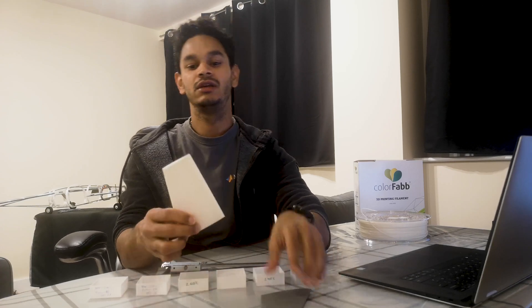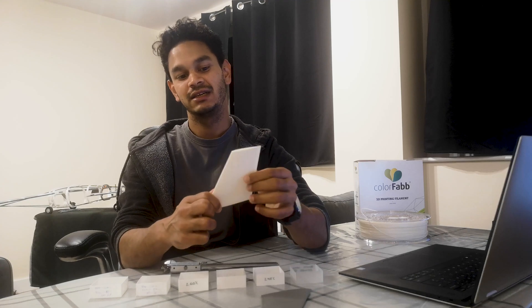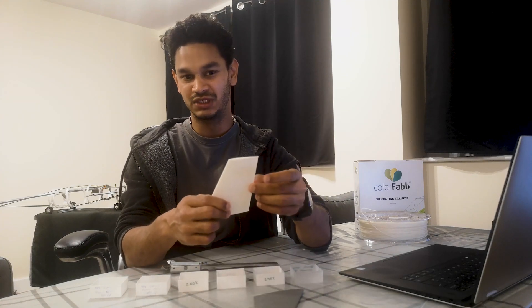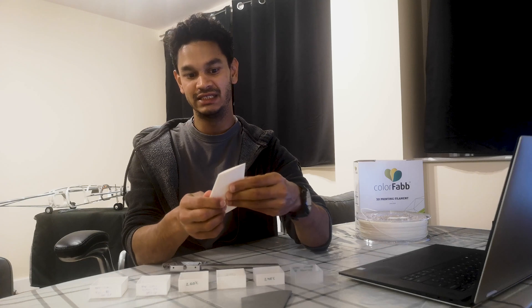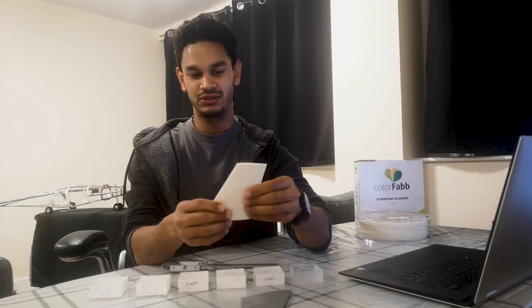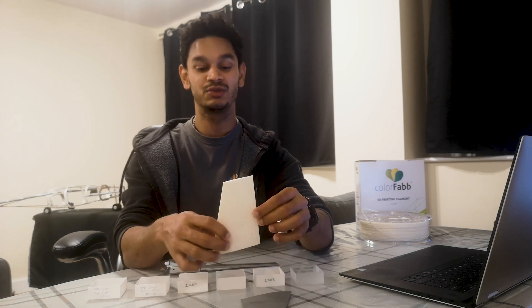The main disadvantage of lightweight PLA is the rough surface finish — it's not smooth, so it's not well suited to aerodynamic surfaces. ABS or standard PLA prints are quite smooth by comparison. You'd need to sand the lightweight PLA down to get it smooth, but when I tried 120-grit sandpaper it did almost nothing — the material is very tough — so you'd need serious sandpaper to make any real difference.